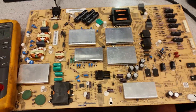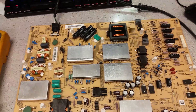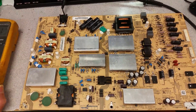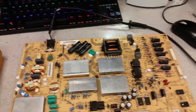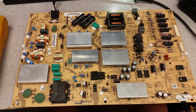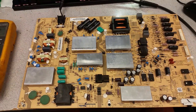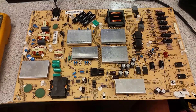The 12 volts for the panel and T-con are confirmed — this is 99.9% certainty that this board is working. There is always a very small possibility of an intermittent problem that doesn't show in a few minutes of testing, but based on solid experience this board is working fine and ready to go. This is how you test the board — if yours does the same thing, you know it's working. Best of luck, stay safe, and don't buy boards unless you have to.